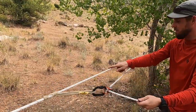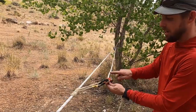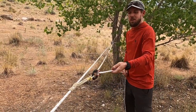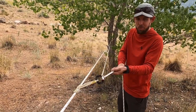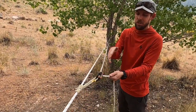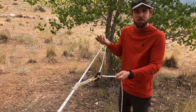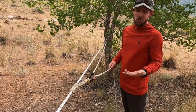As I pull through this secondary pulley I gain mechanical advantage — it should give me three times the normal force I apply. So if I apply a hundred pounds of pressure, it's theoretically going to give me 300 pounds. Since we're in the real world, you will lose some efficiency due to friction in the system.